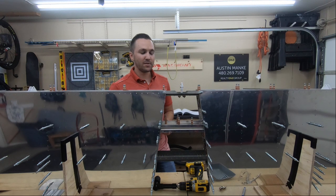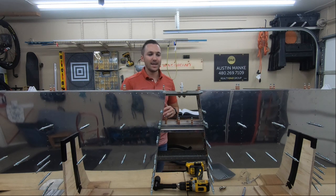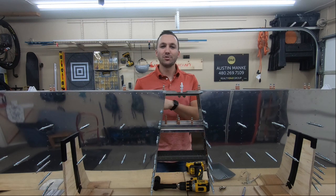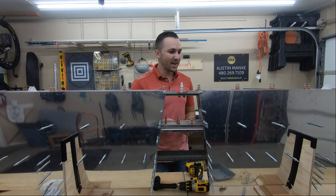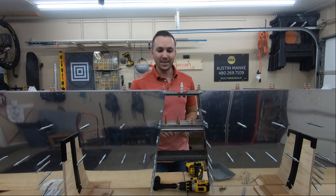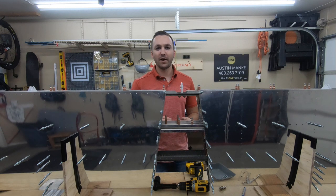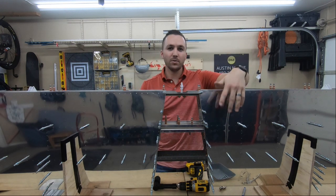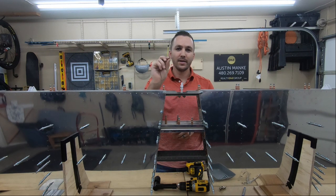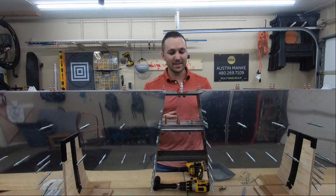It gets interesting because you could almost get away with skipping that step and jumping ahead. My only worry is if there's anything you put together and then have to match drill, or if you have to fabricate something and match it to whatever you're making. What I do is I still stick to all the plans. I've got everything all up to size, and then I go back and verify. So if the next step calls for final size drilling all the holes on the skins, I'll just take the butt end of a number 40 drill and verify it actually fits inside. And I have not drilled any of this yet, and it already fits there.